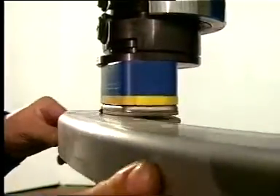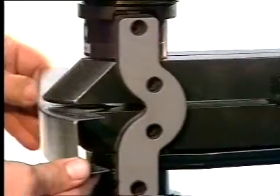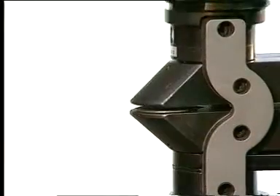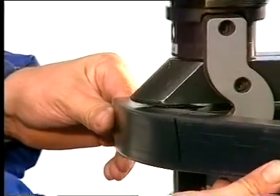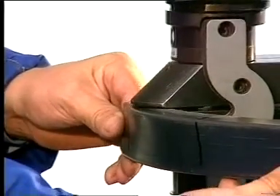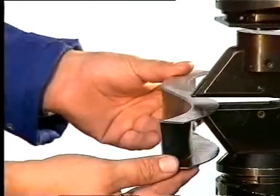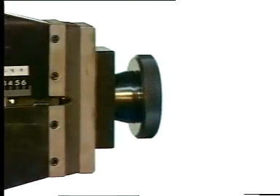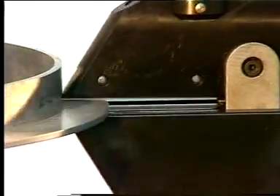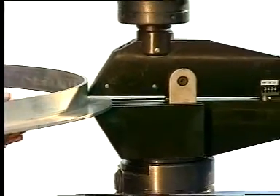This is the result produced on an aluminium angle section. The beak-shaped tool is essential for shrinking U-shaped and acute angle sections. The working surfaces are provided with steel studs or laminated forming dies for gentle treatment of aluminium and stainless steel surfaces. The counterpart to the previous tool stretches the section to an S-profile. Using the same beak-shaped tool, this aluminium angle section is stretched into a curved shape, with the biting surface reaching right into the angle, resulting in outstanding precision and high tolerances.